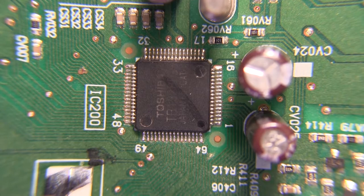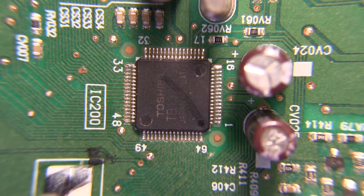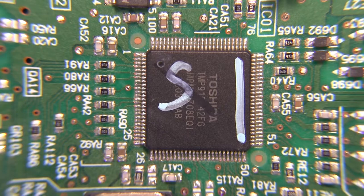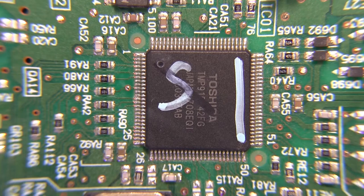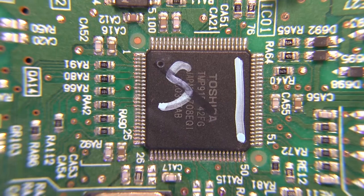The chips we have on the input board: we have a TV1328FG — that there is an audio switch, a video switch, it does sync separation and horizontal/vertical frequency counting. So that's basically a complete package for all the analog inputs. This here is a TMP91FY42FG, and this is actually a 16-bit micro. Basically what this does is all the basic control stuff, like for the inputs — it would control anything that's on the I²C bus, which is pretty much all the chips on here.